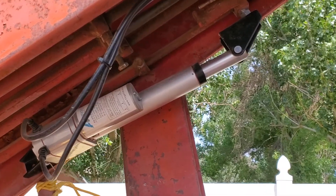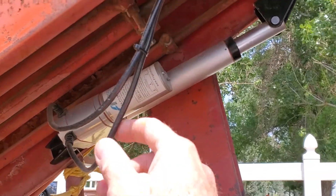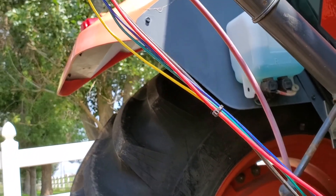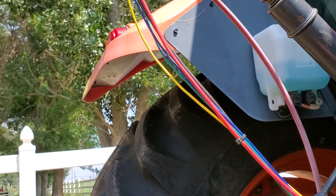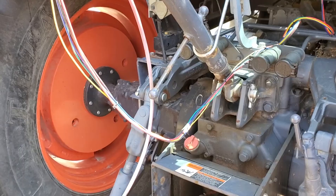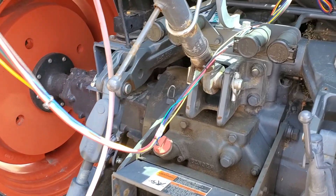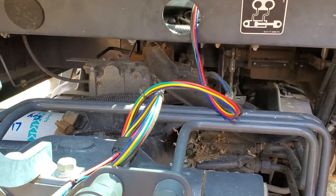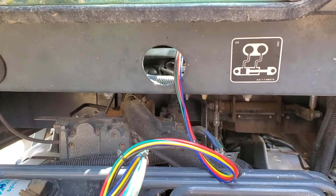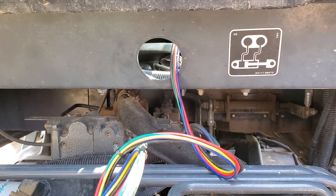There are five wires coming out of here. Two of these are for power, and the other three are for feedback to tell the microcontroller the position of the actuator. These five wires are routed up into the inside of the tractor into a box where there's an Arduino microcontroller with some software and a motor speed controller used to control this actuator.